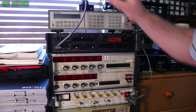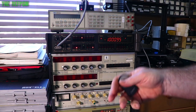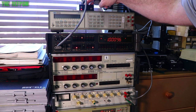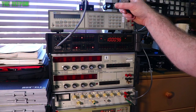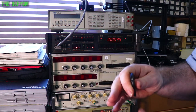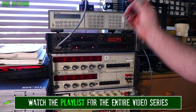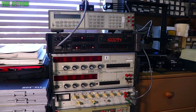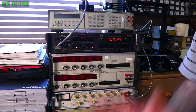If I do a third revision it would require a bigger case anyway, because the space inside this one is used for the BMS. So I'll probably leave this one in this case and build a new one — I've got some larger cases coming. I'll get some boards made, do another version in a slightly bigger case with decade resistor selection so you can choose the division ratio, instead of being just 1000-to-1 it could be 10-to-1, giving more options. Watch out for that video. Give us a thumbs up if you like the video, subscribe and hit the bell icon, and I'll see you in the next one.